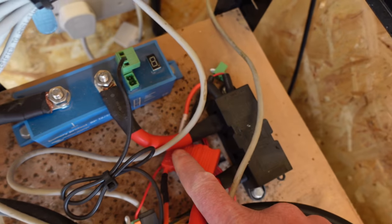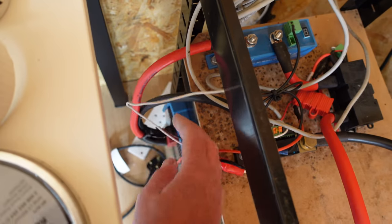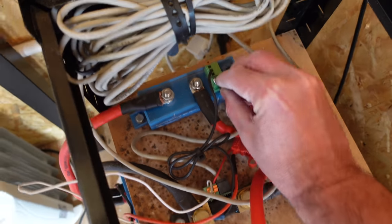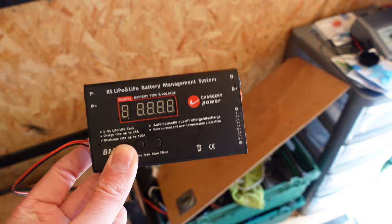Basically, power comes in on the positive, goes through here, and this controls on and off to the inverter which is down there. In theory this should not have discharged, because the jumper wasn't in — when that's connected it will turn on. So what discharged these batteries? It's down to this, or this has finished the job. Here's my theory: about a year ago I probably took this power system out of service because I was doing something else with the shed, turned it into a recording studio. It was left at a resting voltage of probably around 3.1 volts a cell — about 12 volts total for the 4S battery.